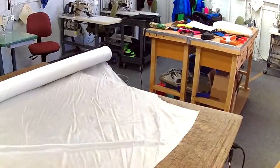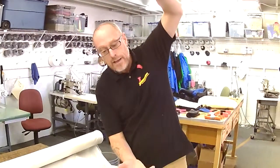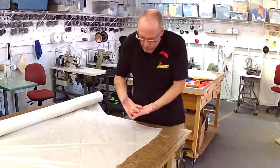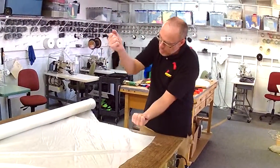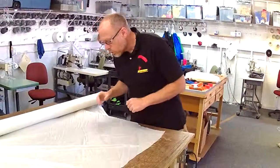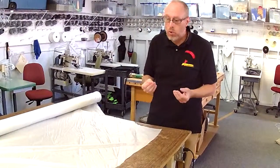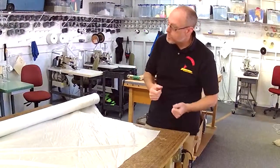When this fabric gets woven it comes off the loom and goes through two giant rollers that are heated, and they compress the weave into itself. It crushes it down and makes it less porous. That process of going through those two big heated rollers is called calendaring — just like months of the year, calendar. And the reason we care about that is it reduces the permeability of the fabric; it makes it less porous, which is a good thing for us.